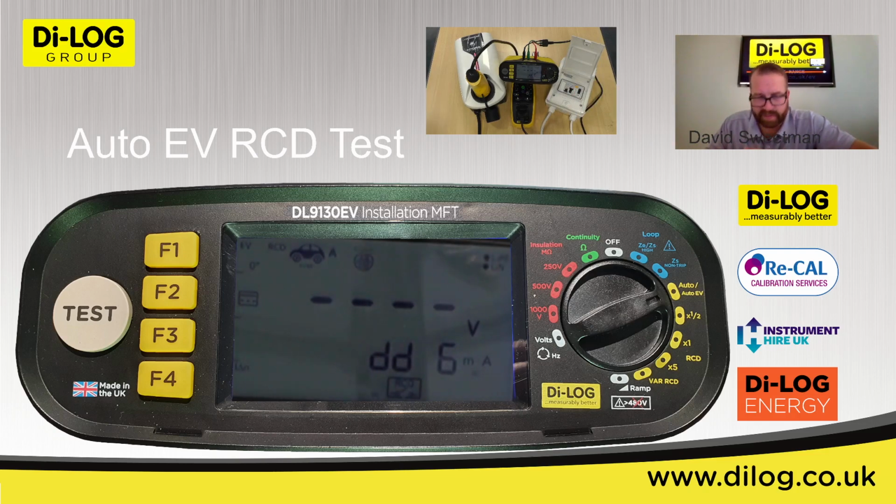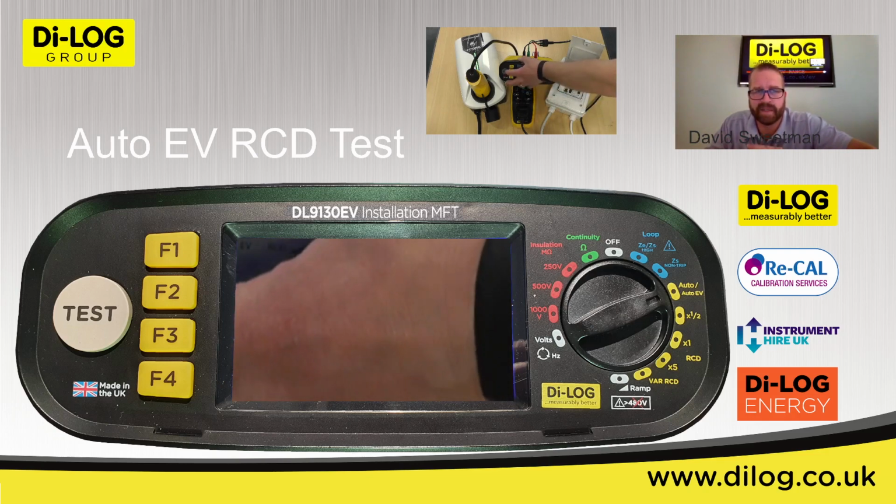So the ramp test is a test that's always been within all multifunction testers for a long time. Rather than tripping time, it gives you tripping current. It's quite a good idea for this because a 30 milliamp RCD, most of us know, never trips at 30 milliamps. It's always lower. It's 21, 22 generally. If it goes over 30 milliamps, then you're in trouble. And if it's under, it's absolutely fine. If it goes too far under 15 milliamps, for example, then that's not great. You're going to get nuisance tripping with that as well.